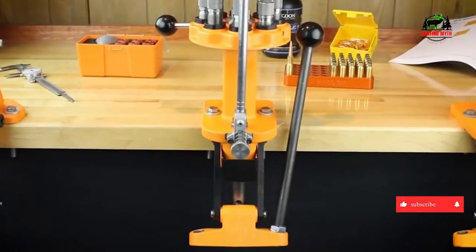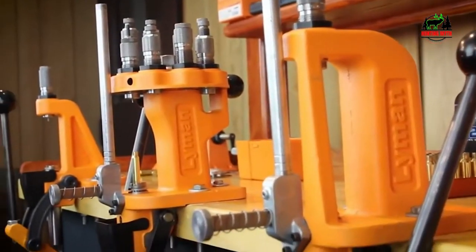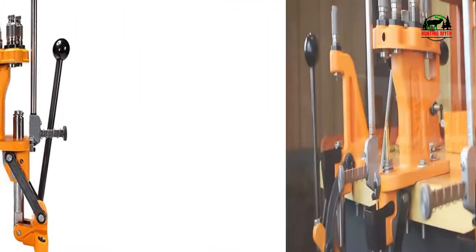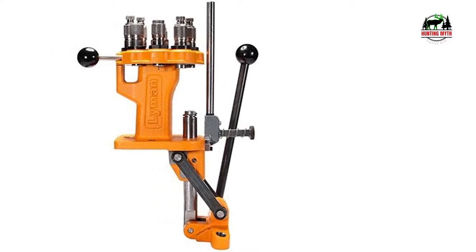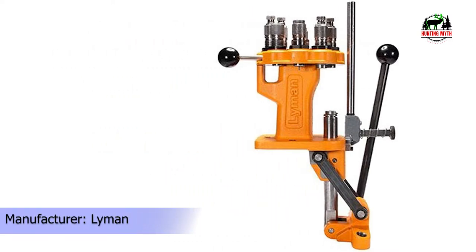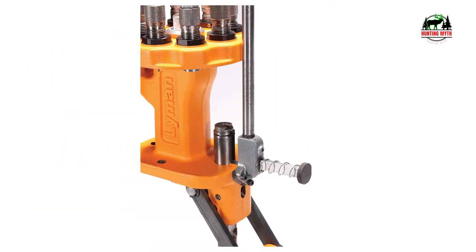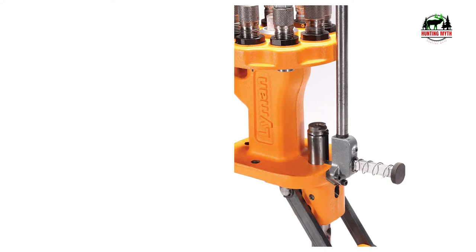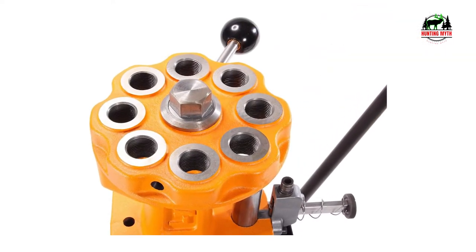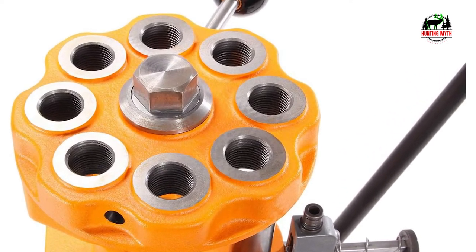Work the press handle and you will feel the tight, precision fit and smooth operation. Unlike many competitive presses, the Brass Smith All-American 8 Press comes with a newly designed straight-line primer feed. The straight-line primer feed is completely reliable and simple to use. Simply push the priming arm forward at the bottom of the ram travel to position it beneath the shell holder. For added safety, the primer feed comes with a heavy steel shield, which surrounds the primer tubes.